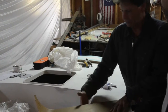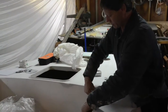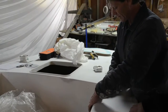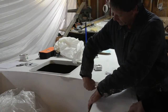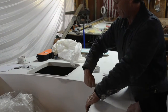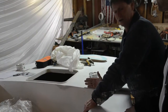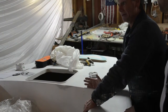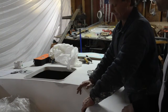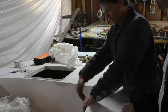Then, if this is a vertical that we're going to put in here, drill a hole. This has a little routed thing, and you've got your rope here. Find out where the hole is right behind that, drill a hole, then stuff the rope inside on the other side and fan it out on the back side. So when it cures, it's a cleat, and it's locked right in place. It's tied your skins, tied this, all kinds of cool stuff. Or you can stick it in place, goop it up, fill it, fair it.